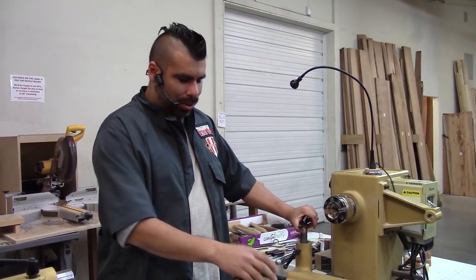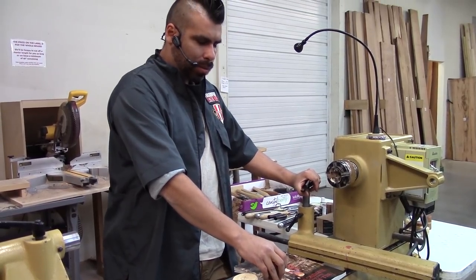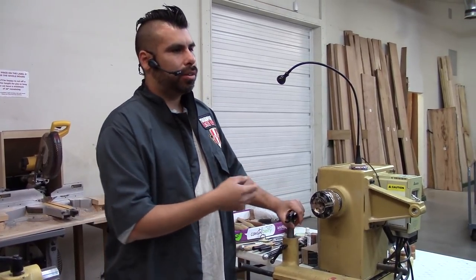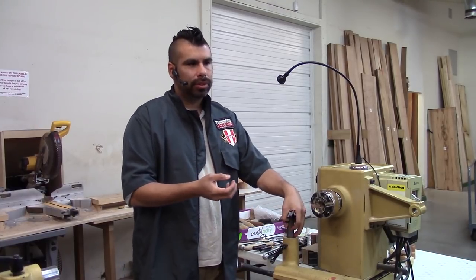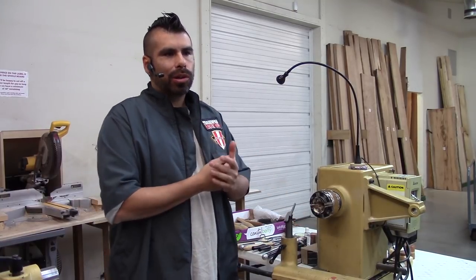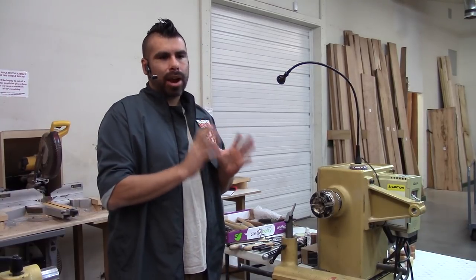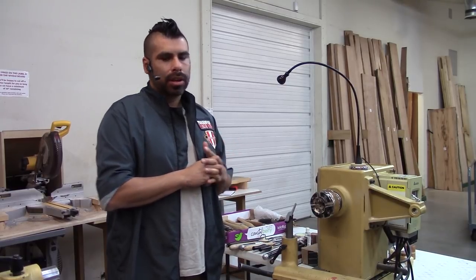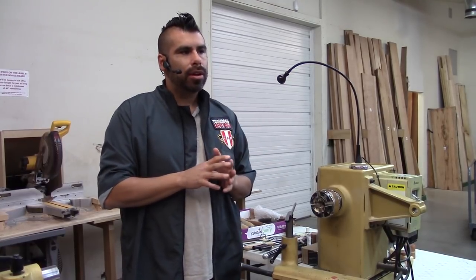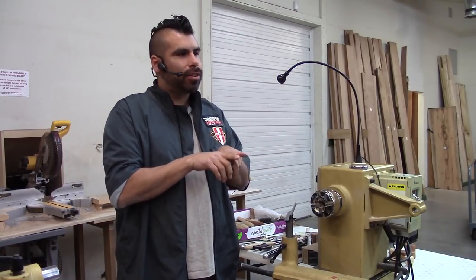And we now do it on the hardest woods we can possibly find. One of the main frustrations for people starting to thread is not having the right material. It has happened to me, and I bet it has happened to a lot of people that have held a chaser in their hands and started threading. Having the right wood is the main thing. For this, you not only find the most dense wood, but you gotta find the most dense with the tightest grain you can find.